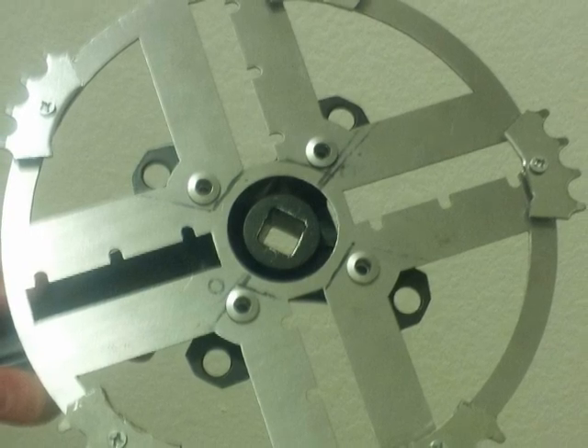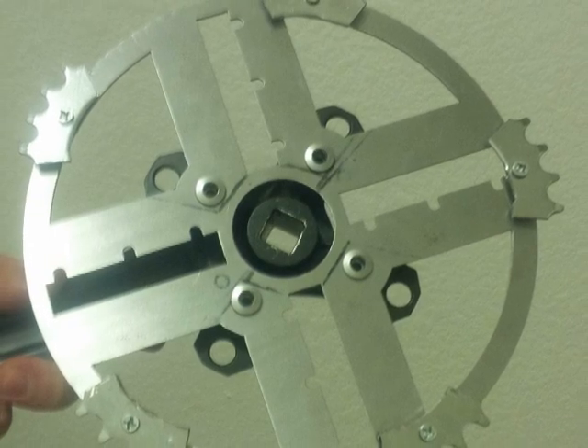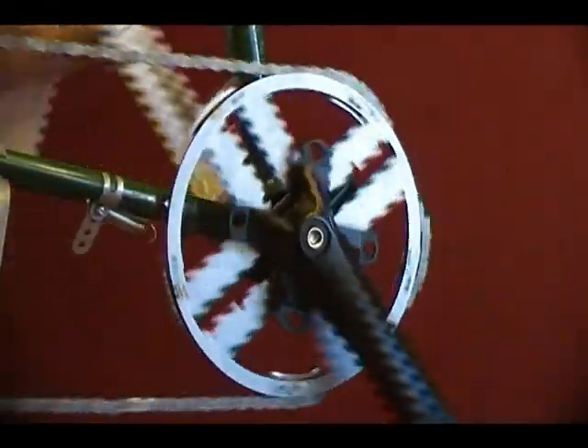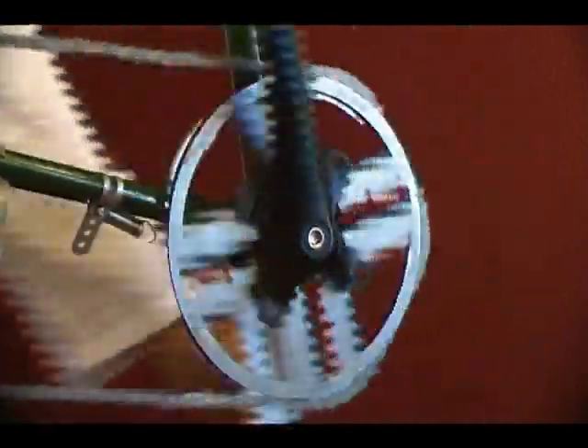I think the most practical will be either five or six gear segments. While it has not been possible for me to fabricate a functional five-gear segment version which can change gear settings, I was able to make a rough and ready model of five gear segments affixed to the periphery of the base plate. When this model is run with a chain, you can see it is significantly smoother, effectively eliminating the lumpiness of the four-point version.